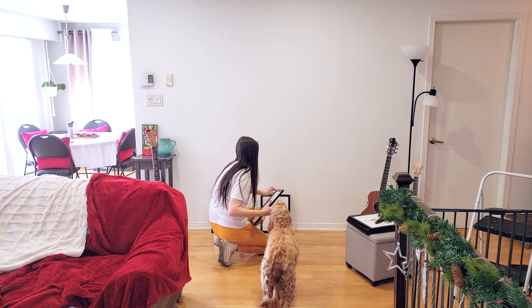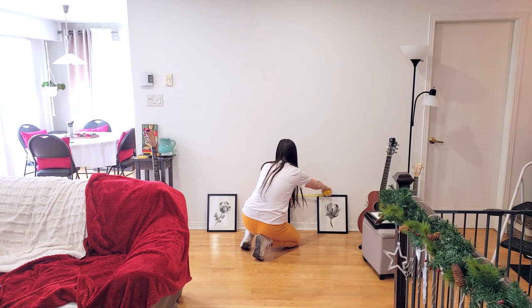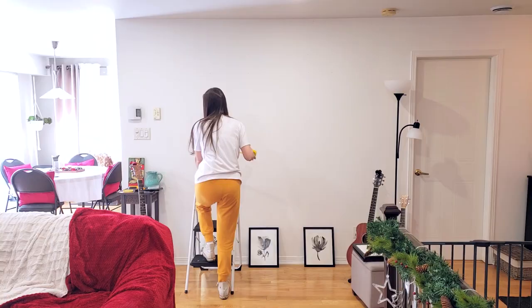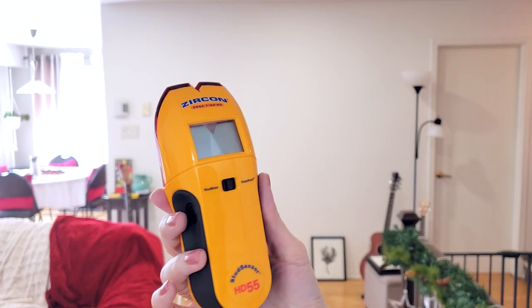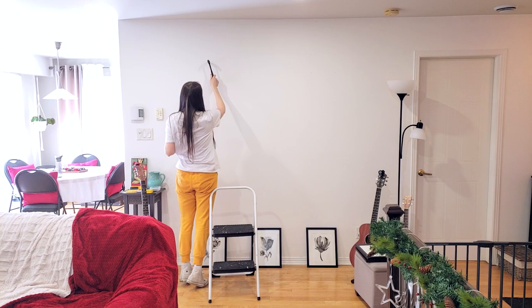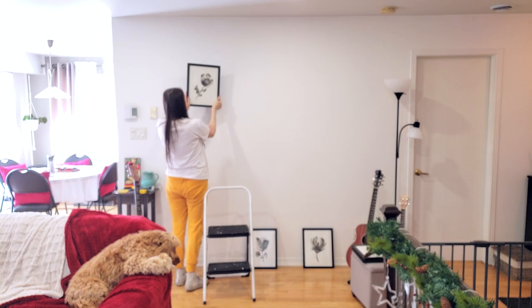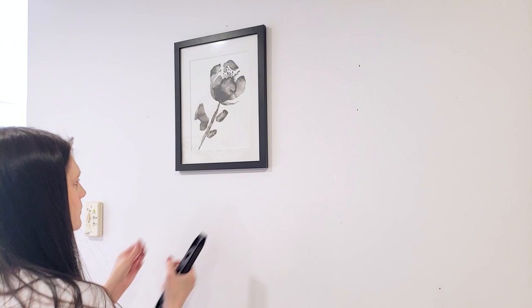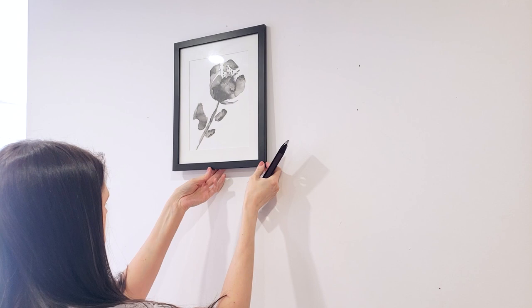I'll be doing two rows of three, so the first thing I decide is how much spacing I want between the paintings. The second is how high on the wall I want them — the height is the tricky bit to get not too high and not too low. I'll do 10 inches between frames and 14 inches down from the ceiling. I'm using a device to make sure I don't hit any electrical wires while putting a nail in the wall. Since the fastener is two inches down the frame, it's actually 16 inches from the ceiling. I use a level to keep everything straight, and a little piece of poster gum on the bottom of each frame so nothing slides or wobbles.